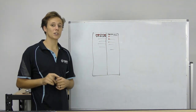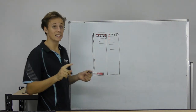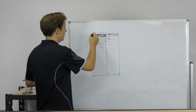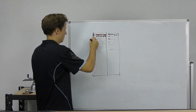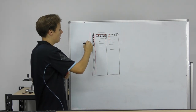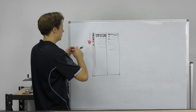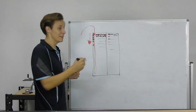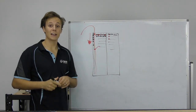Really, really handy. Now, another feature that most breadboards will have, which is super, super useful, is power rails. And you'll see these running down the side here. Well, you'll see the grid, the dots. And again, these are spaced out into 5 sets of 0.1 inch pins, or 2.54 millimeters as well, there's holes here as well, and then there'll be a break, and then another set of 5 holes. And the beauty of this is that these are connected that way, which means you can, as we were talking about before, take a 5-volt wire from your Arduino, say, plug it into one of the holes here. They're usually colored red and blue or red and black, something like that. So you can take a wire, plug it in there, and suddenly every hole on that strip will have access to 5 volts. So you can take a jumper wire from there over onto your circuit, and that's going to have 5 volts on it as well.